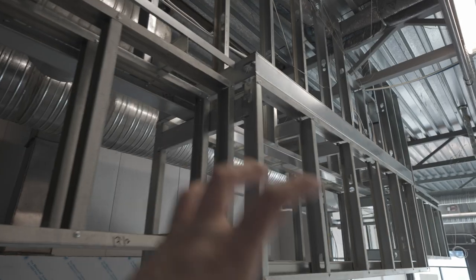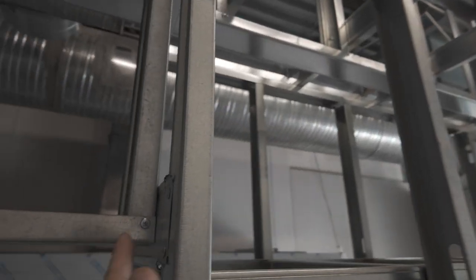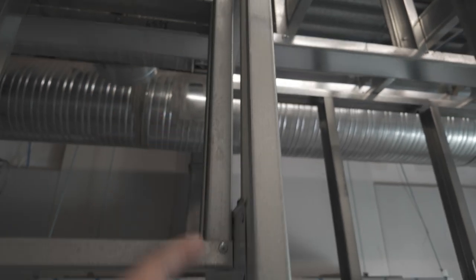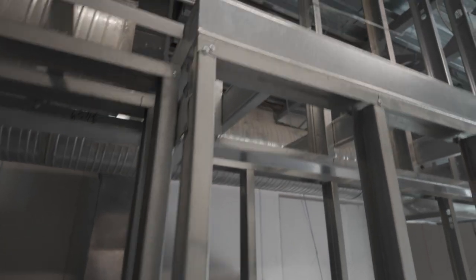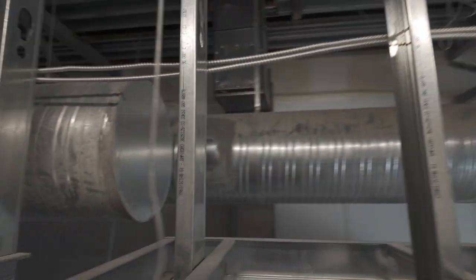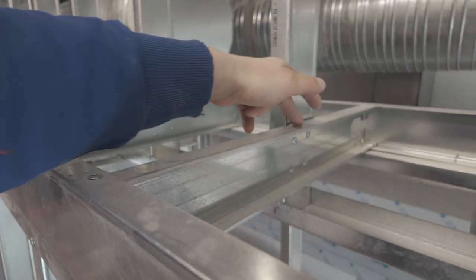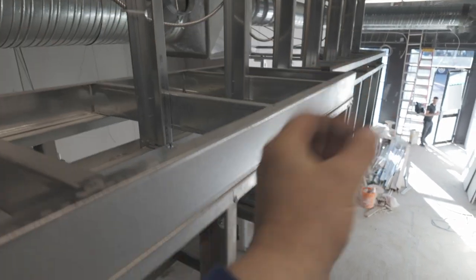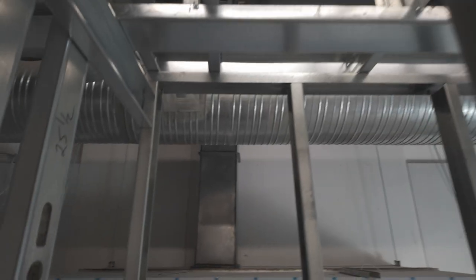This middle piece - it comes out four inches and drops four inches. Basically we lasered up the end right where we stopped our steel. I've screwed a 3-5/8" stud to the middle and squared it - I shot my elevation up before. This is just a bigger size, so I've built this like a sideways wall. You can see the outline - now all I have to do is drop it and square it out using my tape measure and framing it. The 3-5/8" structural one is dropped below, running down the middle on the inside, and I've got clips on the ends.